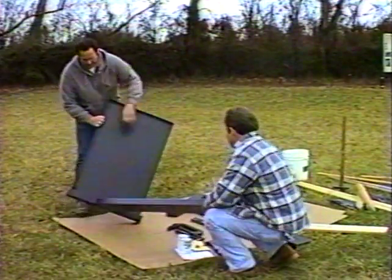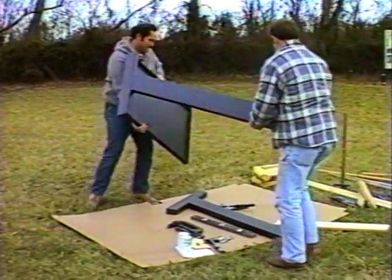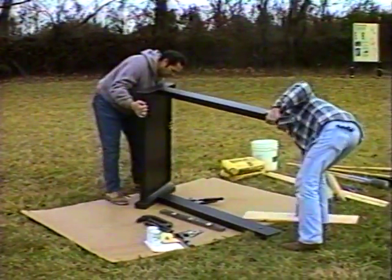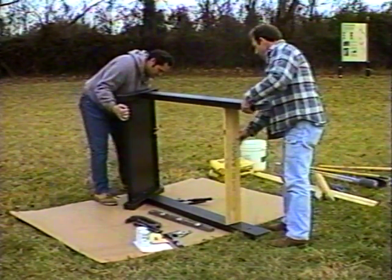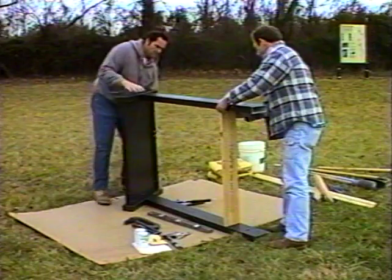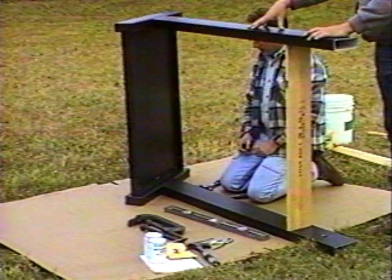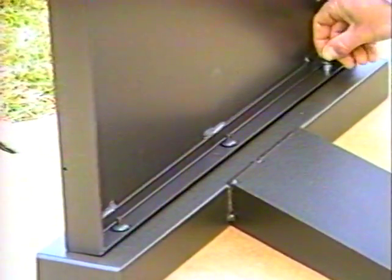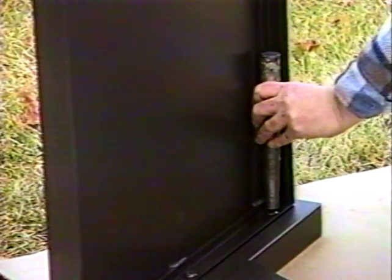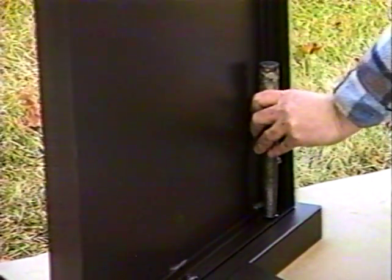Turn the subassembly over and lay the left edge of the frame on top of the left leg and crossarm. Place a pre-cut leg spacer board between the legs about 2 feet up from the bottom. The spacer keeps the leg joints from breaking and ensures that the legs are parallel when setting the exhibit. Again, align the holes, insert the rivets, and set them as before. The low-profile exhibit base is now ready for installation.